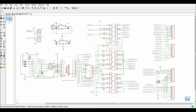Now, as part of the stepper driver, steppers are fairly specific, but you need to home them from time to time. Hence the two opto encoder end stop settings here. So again, these could either take a mechanical switch as an end stop. The idea here is to have two optical encoders or opto interrupters feeding off to home the conveyor each time a cup is exactly placed underneath the nozzle of the coffee machine, and stopping it in time, make a cup of coffee, and advance it by 1 cup each time.